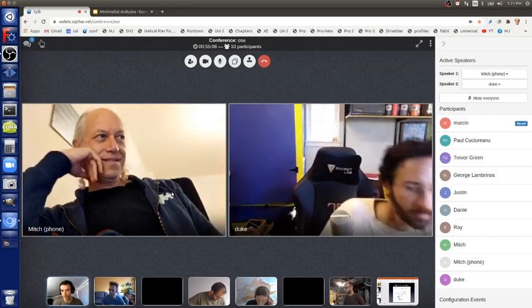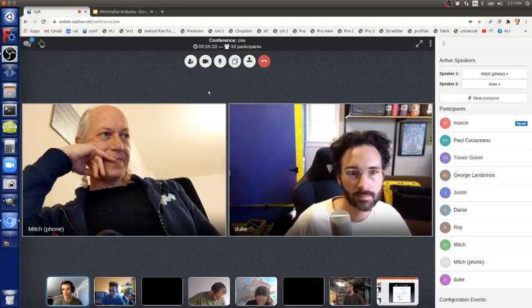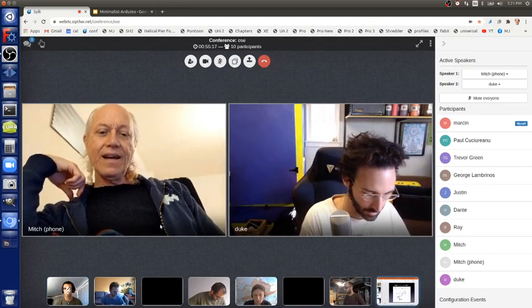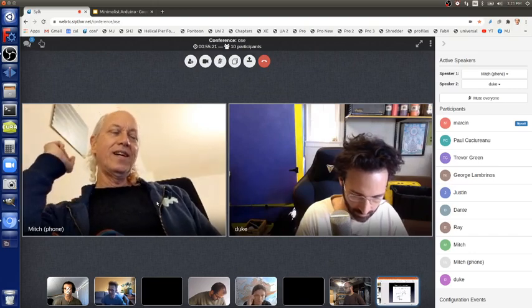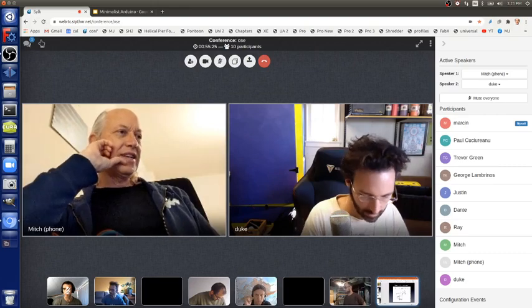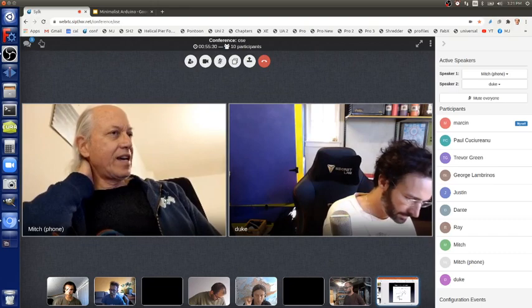Can you just put it across the red and blue rows on top of the board? Or you have to put it close to the chip? Yeah, you can do it pretty much anywhere, but it's nice to do it next to the chip, where it will short out noise at the chip, which is where we need it shorted out. But doing it right at the red and blue wires from the power supply is also okay.